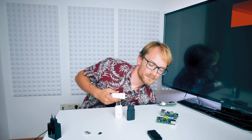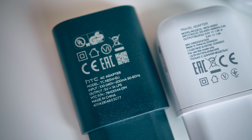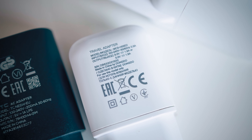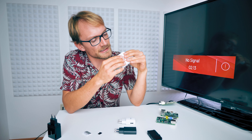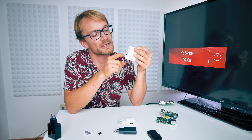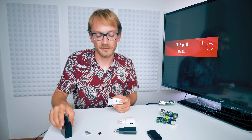Instead, I used three different power supplies. I started with an HTC 1A 5V supply — the one that came with the HTC Vive. The next step up is a 1.8A supply from LG that came with my phone. And lastly, an Anker unit — a 2.4A power delivery unit with both a USB-A port and USB-C. 2.4A on USB is pretty much the same as any decent USB power supply.